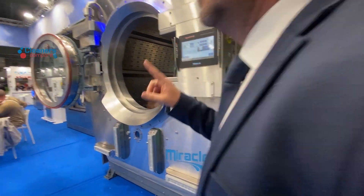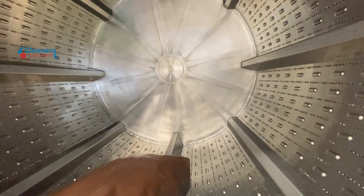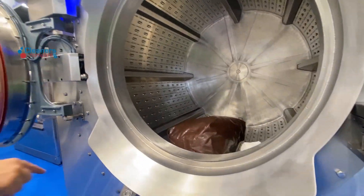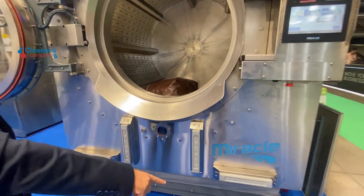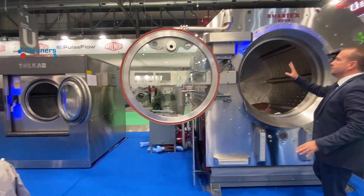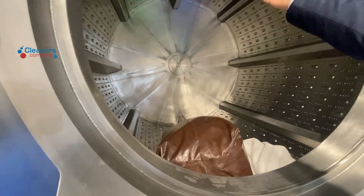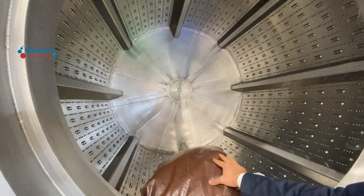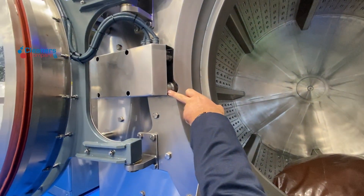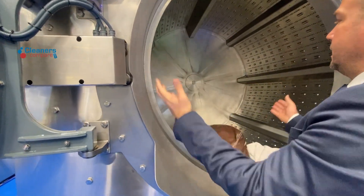This is the ultimate test for any washer-extractor — this is one piece, almost 20 kg, and we can extract it here without fixing the machine to the ground. The principle is that we have small cells in the front and the rear. As you can see, the machine detects where the imbalance is, and then quick-reacting water jets inject water into the right cell to balance it out and make the load homogeneous again.